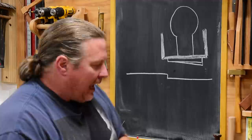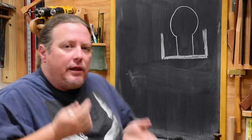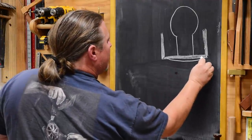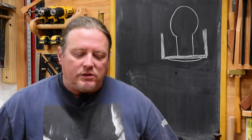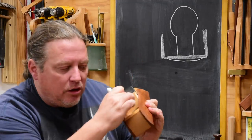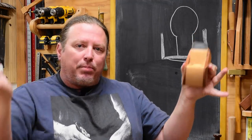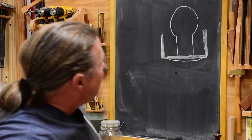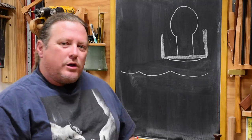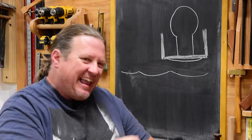Now using a cambered blade, we don't really have to worry about that because we only protrude down enough so that you see the slightest curve coming up underneath. The corners are going to be recessed up, which is exactly why with my wooden hand plane I put in a very wide blade — I'm only using probably three-fourths of the total blade because the corners are up inside the plane and it just kind of feathers out. So when I'm planing, I get these grooves going across the board, but it's such a microscopic angle you can't feel it, you apply finishes and it's invisible.